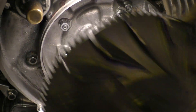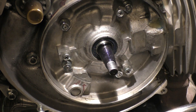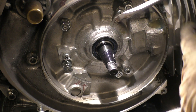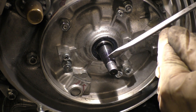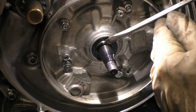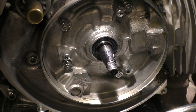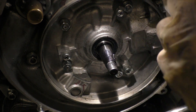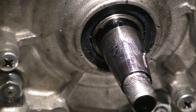Now, according to which marks are cleaned away, we know if they fit each other or not. What do we see? It's only light here — it's black where I colored it. So in this case, this stump does not have the original measurements; it's too small, or this cone part is too big. Only about 30 to 50% of the needed contact area is present.